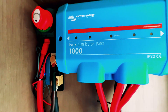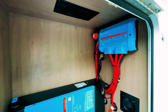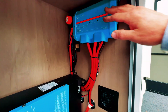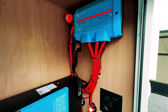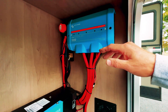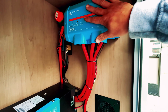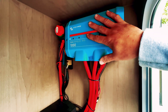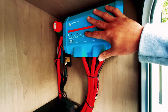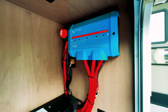All wired directly to the Lynx distributor. If you are building a lithium conversion and you're still using bus bars and fuse holders and all that old school stuff — stop. Use the Lynx distributor. As long as you're using Victron stuff, I didn't use the Lynx shunt with this one so we don't get the power light or fuse blown status indicator, but you'll know pretty quick if you've got a blown fuse. The Lynx combines both the fuse holder and bus bar functions into one unit. It's about the same price once you factor in the cost of making additional jumper cables and buying the fuse block and bus bar separately. Just do the Lynx.